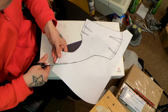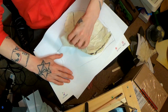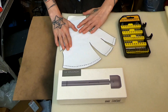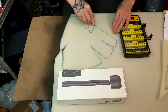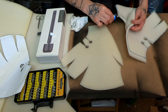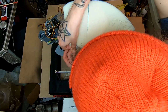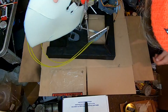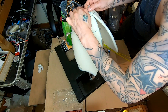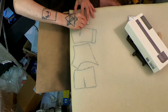It just screws back in place — you fit those through the easy connectors and tighten them up, and the two servos pushing forward and backward basically lower and raise those rods. When there's a skin on here there'll be some resistance and flex in that wire, so I hope it'll be more of an up-and-down rather than a forward-and-backward motion. I'm making some basic body patterns — I've never really made a puppet body before, just following along to some YouTube videos. I create some shapes, trace them onto the foam — it's puppet foam.